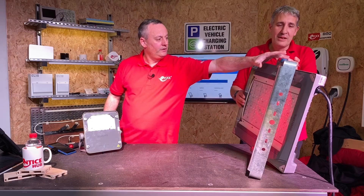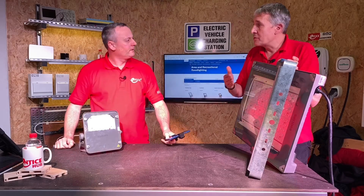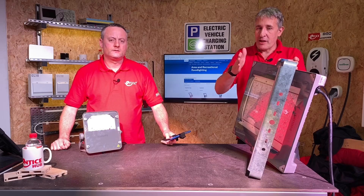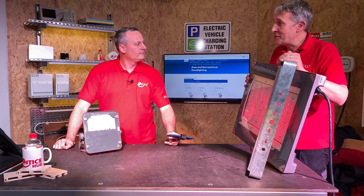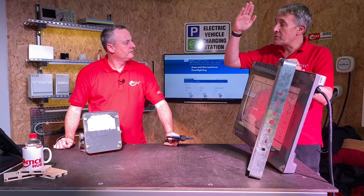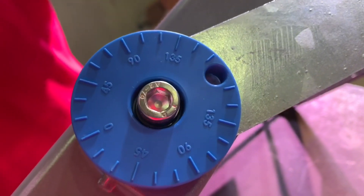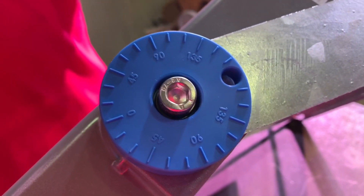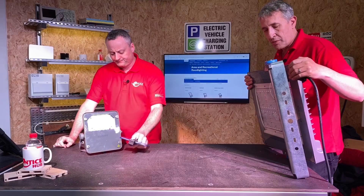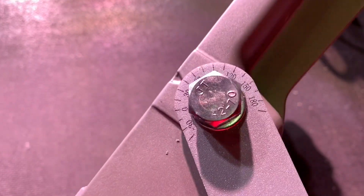You've got some blue caps there on the side of yours, and I've got some dials on the side of mine — can you explain what they are? So we spoke briefly about optics — if you're using optics you're probably going to do a detailed design study of the application. You can adjust where the light goes by slightly tilting the fitting. You'd set it — say 20 degrees up from horizontal — in your design. There are useful markings on the side so you lock that into position, it gets left in the handbook, and if it ever got knocked you'd know to return it to the appropriate angle. And that's the same on the smaller one as well — it's cast into the aluminium, so you can set the angle on that one too.